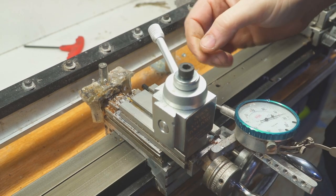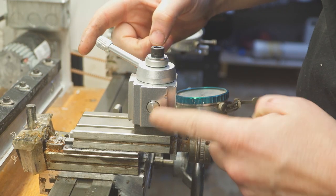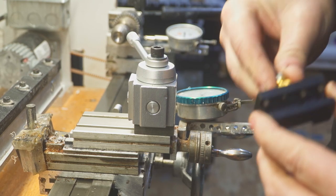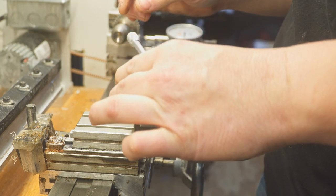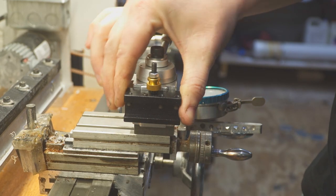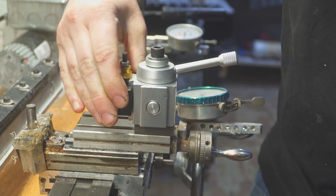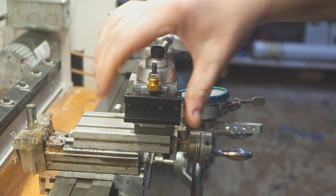Now let me show how the tool post works before getting to calibration. There's a plug here, and as you turn it, that comes out — it's a simple cam system. When you take your tool holder and slide it down onto the dovetail, then turn the cam, it's locked into place — it cannot move up or down or any direction. Then you simply take that off, turn to your next bit or process, and lock it back. It's a very quick way to change tools.